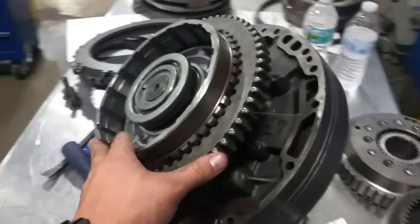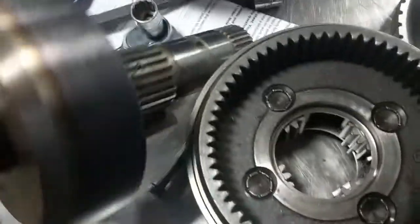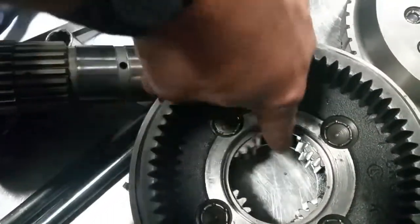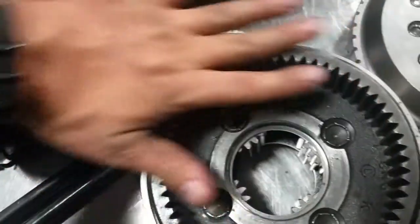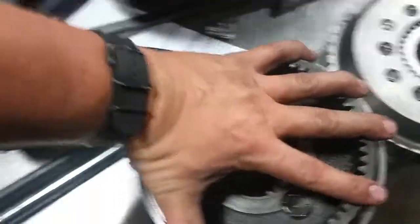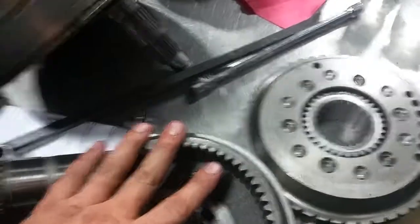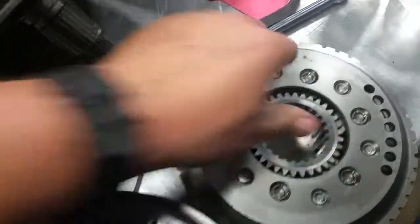So some of the makeup — you've got ring gears, you've got planetary gears, and you've got a sun gear. Sun gears are right here on this main shaft. How do these work? Sun gears go into planetary gears. Now these planetary gears work like the spider gears on a differential — they're really just for spacing and allow it to turn and keep contact. They also disperse weight over the whole system. The way this works: as you switch gears the carrier will turn, as you switch to a higher gear the sun gear will turn, and then it'll switch clutch packs and then the carrier will turn and the sun gear will turn. That's how you switch gears with these things.